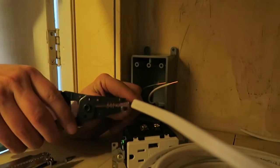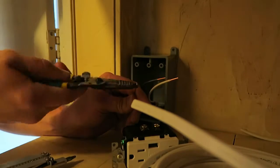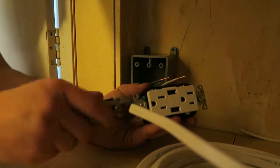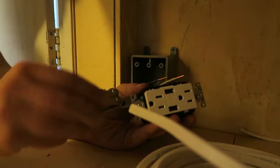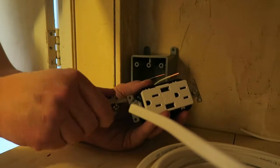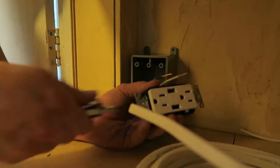Now I'm pulling off the outer insulation as well as the inner insulation below. I'm stripping the wire back approximately ½ an inch. I'm putting a horseshoe-shaped bend in the end of the ground wire so I can hook it on the ground screw. I'm attaching the ground wire now. When I did install the ground wire, I made sure that the grounding wire horseshoe rotates around the screw in the same way that the screw turns. It makes just the installation a lot easier.